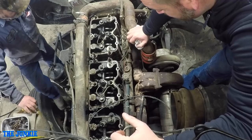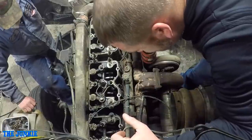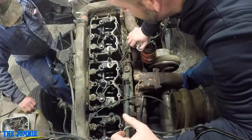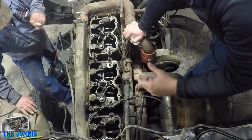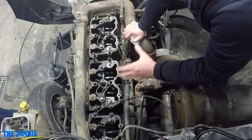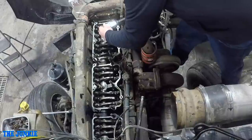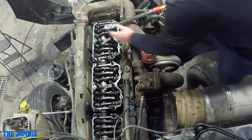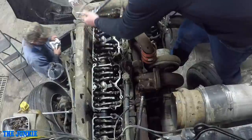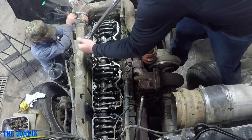Well, it's odd that that's on the same head - it's got a broken bolt too. The broken bolt is back here, and that's usually where they break. We'll get the jake brakes off of this and check the overhead, make sure that that's an adjustment. We're going to take the jakes off, check the overhead, and then I'm going to call the customer and tell them that we got some diagnostic problems and see what he wants to do.